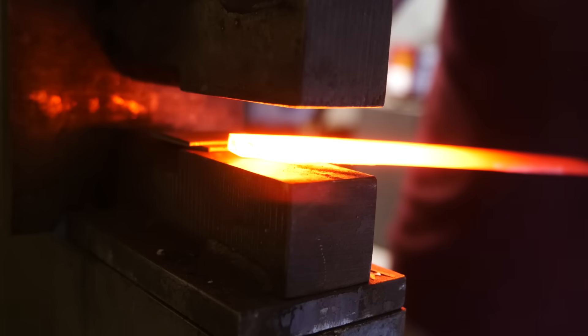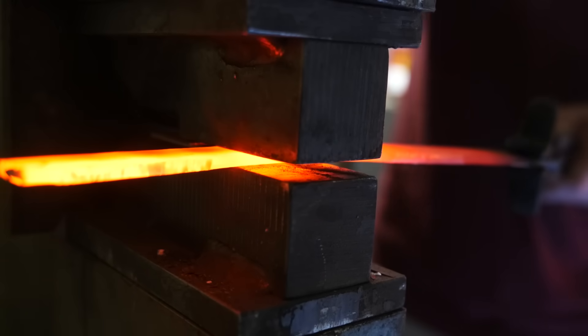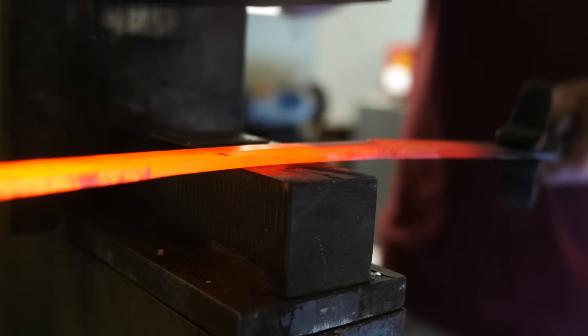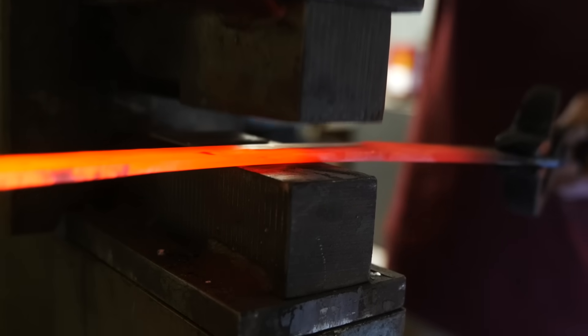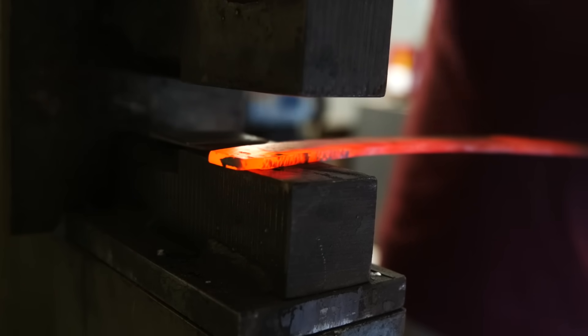It's really interesting. The carbon in our graphite powder will gasify at high temperatures and diffuse through the air into the steel. It diffuses slowly and it's not very efficient, but we can mitigate these problems and help this along by adding sodium bicarbonate, or baking soda, to our graphite powder.